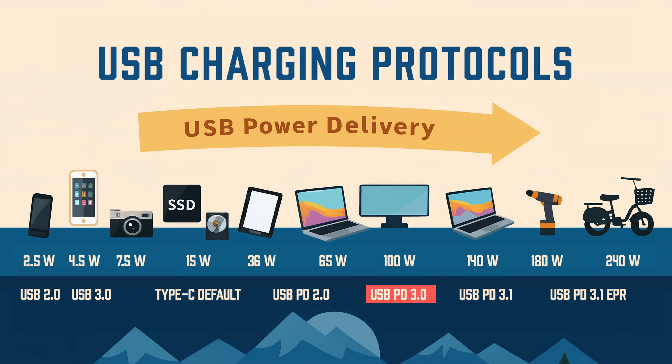If you want to include DC-to-DC charging in your build, you'll need to consider the types of devices you'll be charging and choose a converter that supports a charging protocol that can deliver the power you need. Modern phones and laptops are well served by USB PD 3.0 and above, which can provide up to 100 watts and includes PPS — Programmable Power Supply — which allows the charger to adjust output voltage in small steps. You can prioritize USB plug type, number of ports, charging protocol, or charging power by choosing the correct model. I'll link to the Charge-It Minis and the PeekAway chargers in the description. Be sure to treat your DC-to-DC USB chargers like any other load in your system — choose appropriate wire gauge and fusing size for the amperage of your charger.